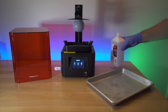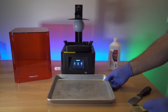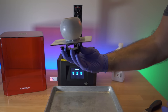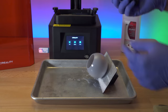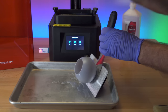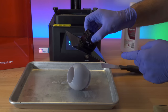For resin printing you're going to need some kind of tray to process the model and plenty of alcohol — this one is 91%, but the higher the percentage the better. Grab your spatulas and brush and place a tray in front of the printer. Loosen the wing nut, slide the build plate out, and you can see what it looks like — it actually looks like some kind of bowl. Set it down in the tray, grab the sharpened spatula, and try to knock it off. It's stuck on really well, but once you get under it a bit it slides right off.